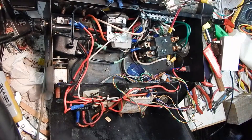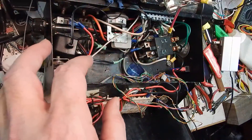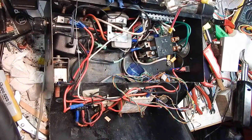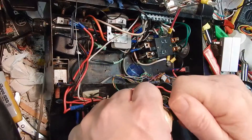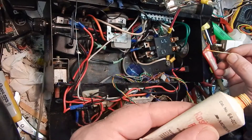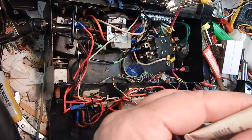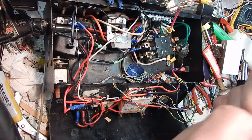You really want to avoid a cold solder connection on one of these — that would be worse than not having any solder at all. If it's cold, it would be worse than just having a raw crimp and letting corrosion do its thing. So I'm looking for some flux, which I have a couple of different types. I'm going to use this old Radio Shack stuff from unknown decades. Great stuff. If you don't have flux you're missing out — it makes soldering so much easier and better.